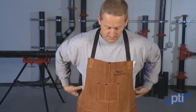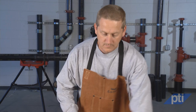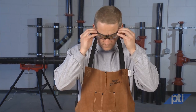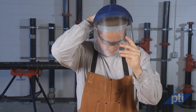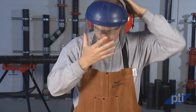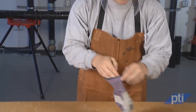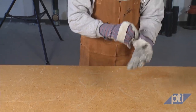Anyone entering the work area must wear personal protective equipment. Depending on the application, use a face shield, safety goggles, or safety glasses. As appropriate, wear a dust mask, hearing protection, gloves, and a workshop apron capable of stopping small abrasive or workpiece fragments. Fragments of a workpiece or a broken accessory may fly away and cause injury to anyone beyond the immediate area of operation.